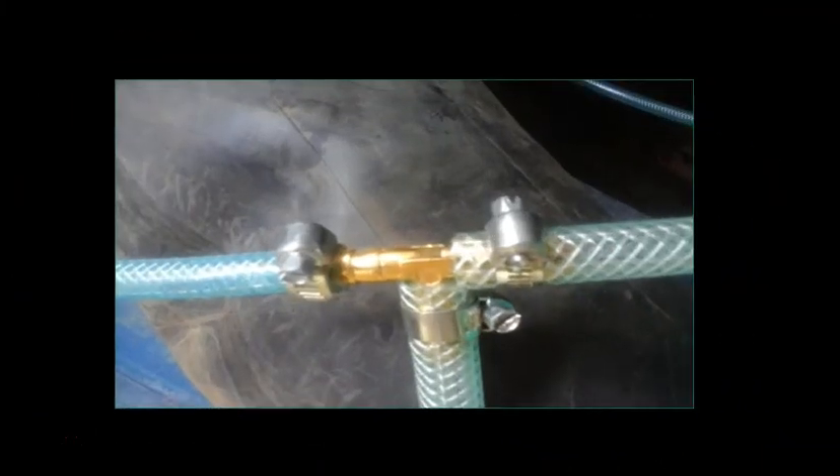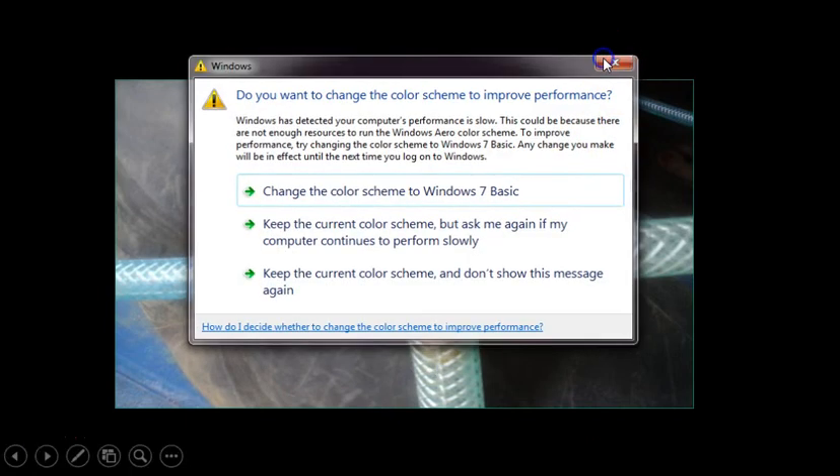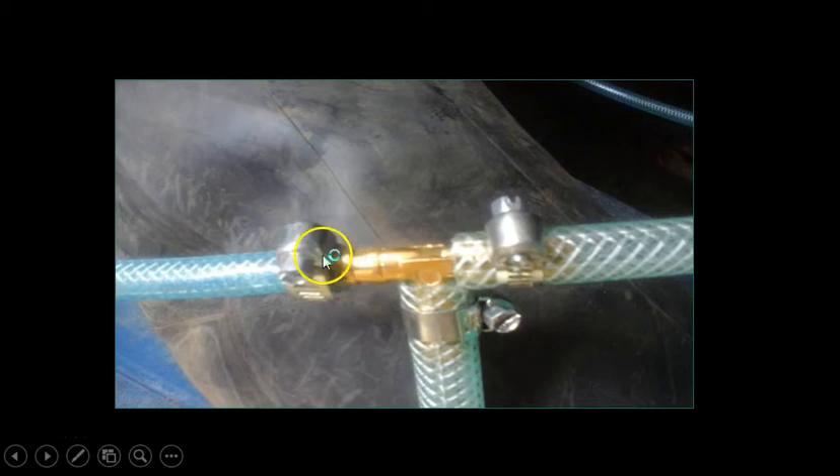Next is the T-joint. The T-joint is used so that from the gas outlet, the gas goes through here and connects to the interior tire of the truck, which captures the gas. The other passage is used for the connection of the biogas tube. There is also a very small clamp which I bought from the hardware. It's very important to bring the T-joint when buying the tubes so you can easily fit the right size of the chemical tube and the clamp.